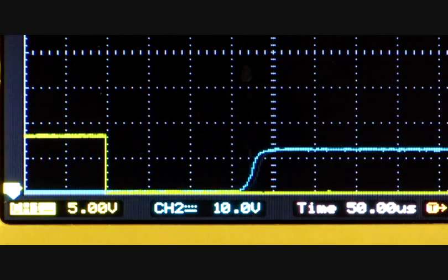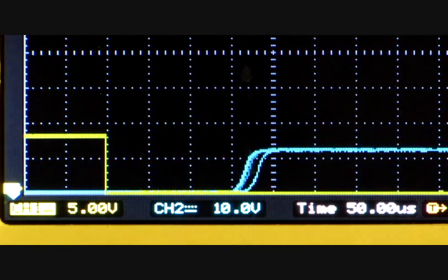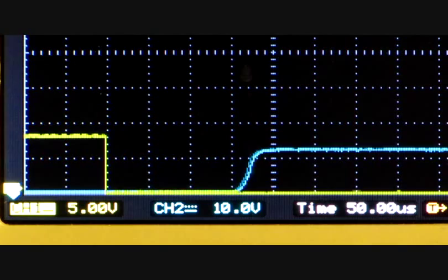Okay, here I have a 812 hertz signal going into the system. It really shouldn't matter what the frequency is going in. The point here is the processing delay. We're set up at 50 microseconds per division here, and there's three divisions, so we'll just call it 150 microsecond processing delay. Now the yellow trace is the input signal and the blue trace is the output signal. And they are inverted because the place I'm looking at is the gate of the power MOSFET. The yellow trace is simulating the Hall input signal to the processor.